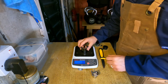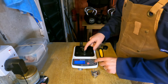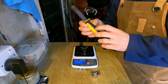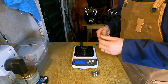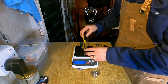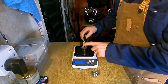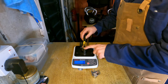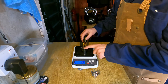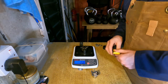So I'm going to show quickly how this works. Tare it back to zero, and I've just got a very simple knife here — it's called a Mora Basic, not one I've been sharpening today, but just for demonstration purposes a nice all-rounder. Apply the knife into the support holder, then press the edge down on the thread nice and slow. You'll see the numbers starting to climb up, and at a certain point the thread is severed — and I get a result of 158.